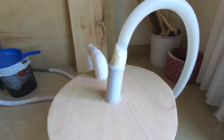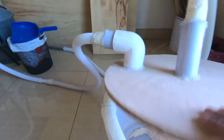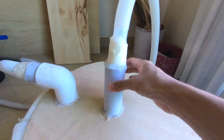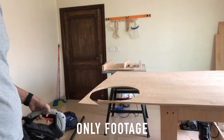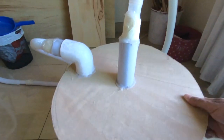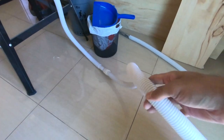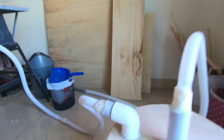The only cost is the pipes — you need this elbow, two of them, one up here and one down here. I used a glue gun to attach them. This long PVC-type pipe is like a water plumbing pipe, hard plastic. The lid is plywood — I cut it with a jigsaw, made a round piece, and put it on top. One pipe goes straight up connecting to my vacuum, and one on the side connects to my table saw or whatever tool you want to use.